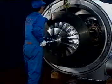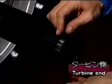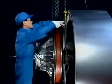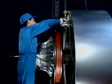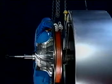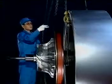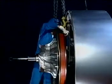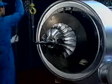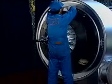Carefully insert the rotor. Insert the pin at the end of the extension tube to protect the shaft from sliding out. Support the shaft protection sleeve with a sling rope. Remove the wire rope from the shaft protection sleeve. Put the rope to the eye nut at compressor end, then suspend the shaft end. Remove the sling rope.